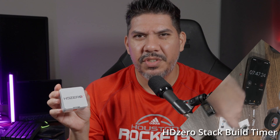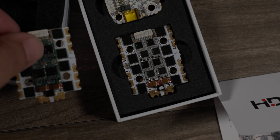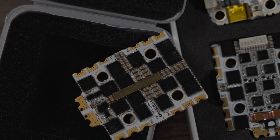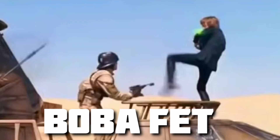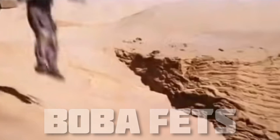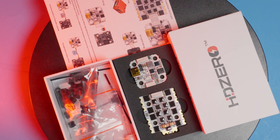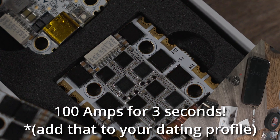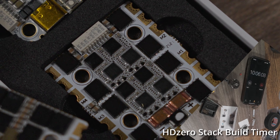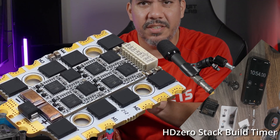You can see at the front it actually has a separate board, and on the back there's a copper strip running down the middle surrounded by very nicely sized FETs — you might say Boba FETs. These two inclusions allow this ESC to dissipate heat better than just about any other on the market. It has a 70-amp rating — up to 30 seconds — and can even go up to 100 amps for a three-second burst. That's crazy. This could be a new evolution in ESC technology. There's also a TVS diode on board to give your motors the cleanest power possible.